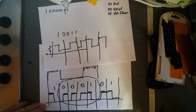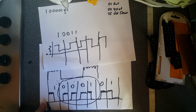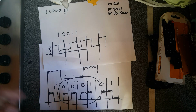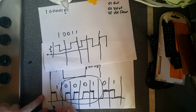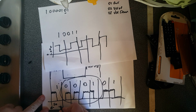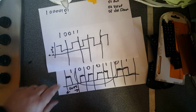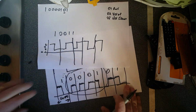The beauty of this is, as the batteries in television remote controls run down, they will actually slow down what is sent. So in the ideal situation, it's 38 pulses per 24.8 milliseconds, let's say 25. So here you're effectively talking 50 milliseconds between here and here. So each individual bit takes 50 milliseconds, sorry, microseconds. Jeez, getting it all wrong. Microseconds, which is smaller still.